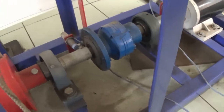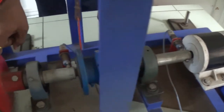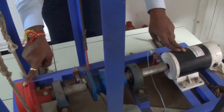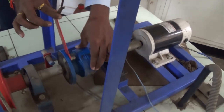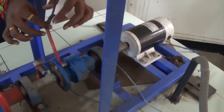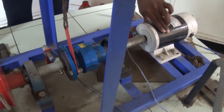The output is over here. As the source is connected to this particular epicyclic gear train, which is connected to your output drum, we can easily find out the input torque and the output torque. And then we have to find out the holding torque, which is over here. We can see this assembly can rotate. Now, we have used this particular strip to find out the holding torque.